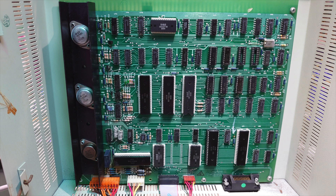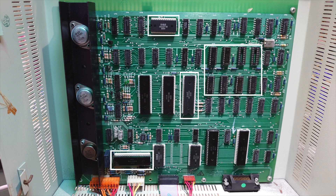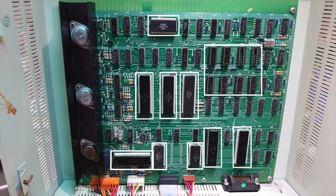Let's have a look at the motherboard and label up all the ICs and see what they do. The board actually has its own CPU — in fact it has two 6502 CPUs. At the top right there are eight RAM sockets, and I'm very lucky this board has sockets on it already. There are two missing because I've already started working on it. The EEPROM at the top there is a 251167-01 for the 8250 LP, apparently the same as a 901467-01. Down at the bottom there are two chips with DOS 2.5 installed, then the Riot DOS 2.5 Micropolis chip which I think is the disk controller, a 6522 VIA chip, and a couple of RAM I/O timers. So this board is quite busy and potentially means a lot can go wrong.